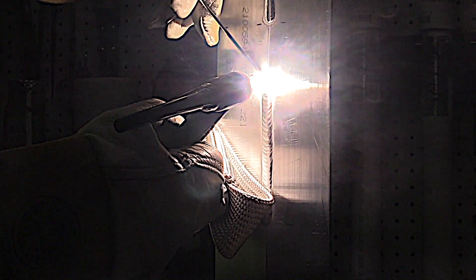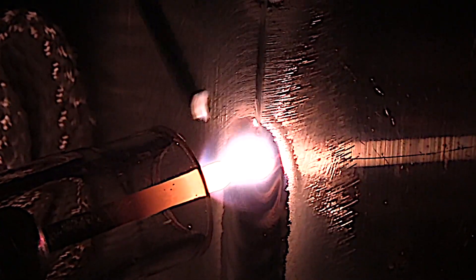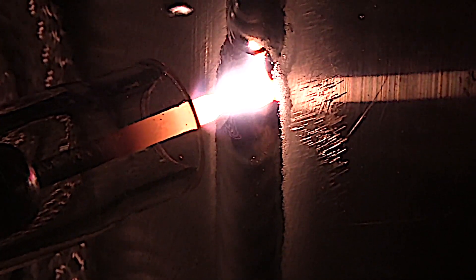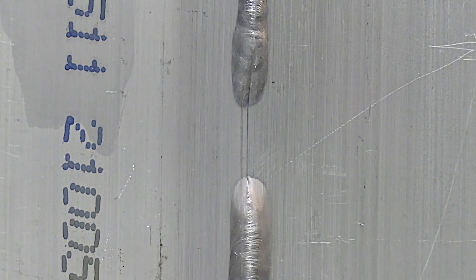Let's take a look at that puddle and talk about it a little bit. You want to watch that puddle sink a little bit in between dabs — that'll tell you you're getting full penetration. Coming up on that previous weld, I'm going to slow down, dab a little less filler, keep moving as I add less and less filler, tapering amperage.